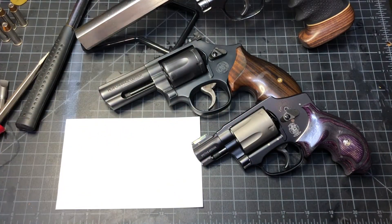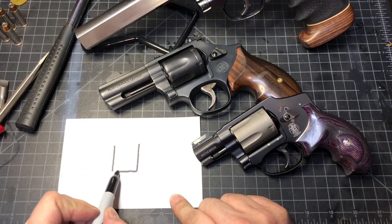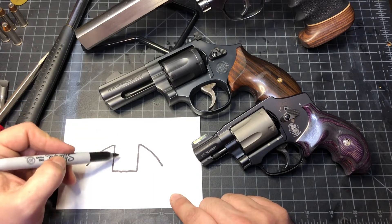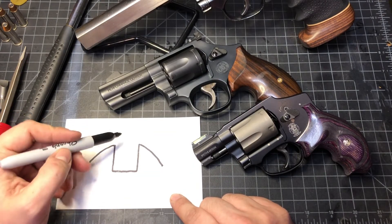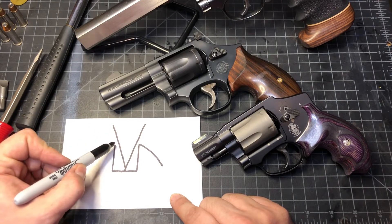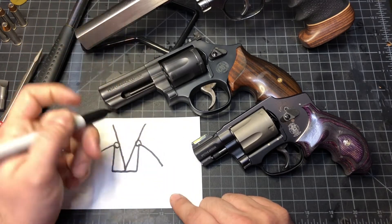Imagine the head of a screw: this is the screw slot, this is the head coming down like this. If we have a tapered end, it is only going to meet the screw head in two locations. It's going to come into the screw head just like that and it is going to bind in those two areas, and when we apply torque it is going to cam out and create an issue.